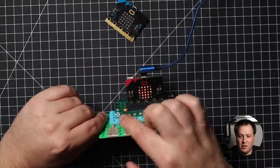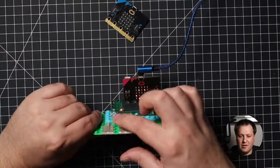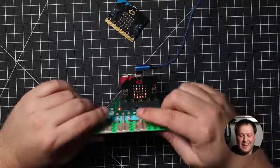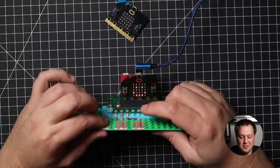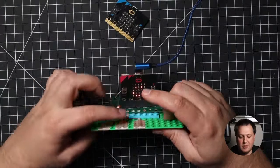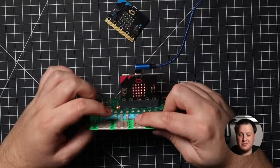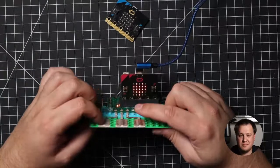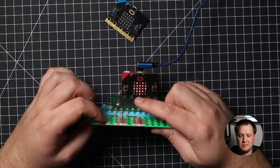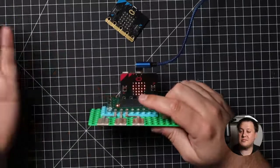So, Pete, do you want to show the code you used to do this on the version 1.5? I don't have that handy, but sure. Basically, the built-in way is resistive touch, where you have to touch ground and one of those pins. Those 3 pins work as analog pins, so they're what's called floating. They always have a value between 0 and 1023. That value floats around maybe 200 or something, but if you touch it, that value will jump up to maybe 400, 500, 600.